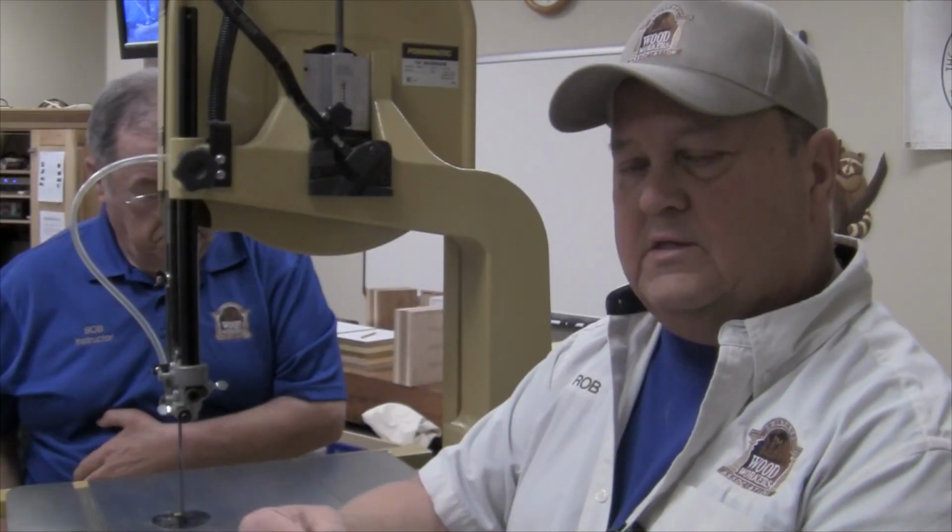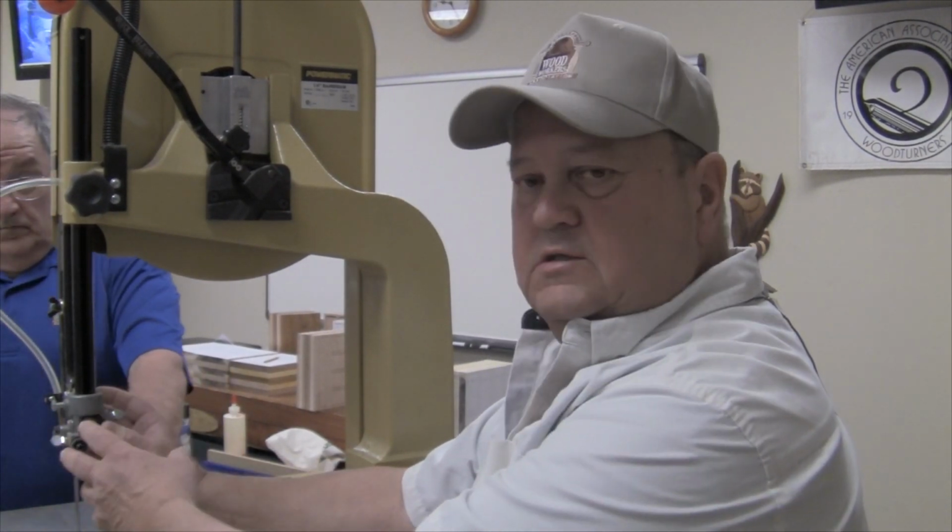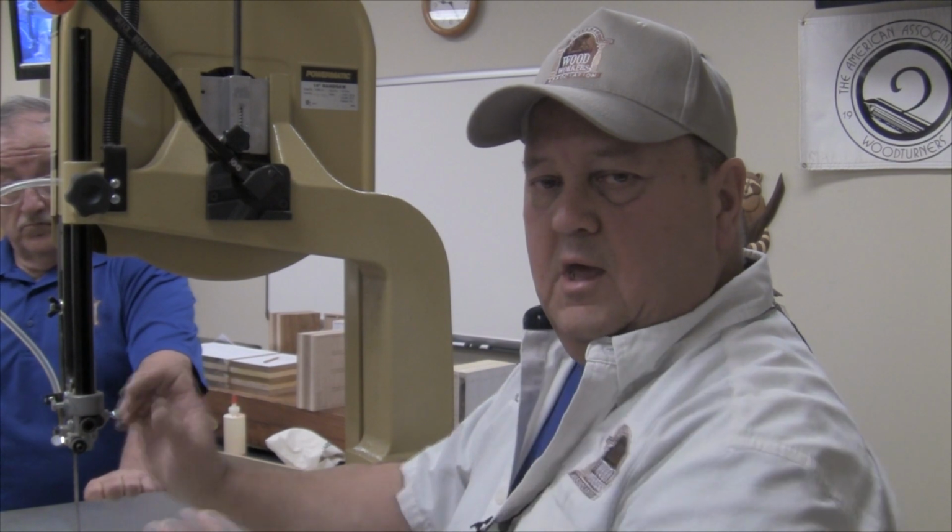It actually rides. That thrust bearing's got a line in the center with a groove on it, and your blade is riding inside of there. And you don't have one on the bottom, so you're not making them even with each other. You're not worrying about the blocks on the side. All you got touching is this one thrust bearing. You take everything else off and put it out of the way, because you'll disassemble this, take out these parts and put that on. And with that tension on there, pushing forward, I can make beautiful cuts with it, nice and soft.